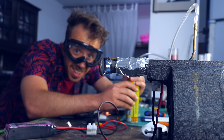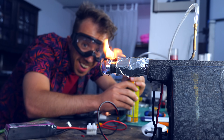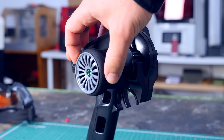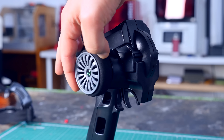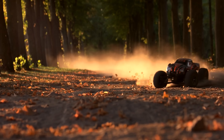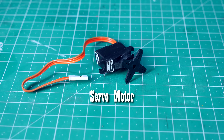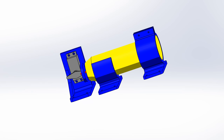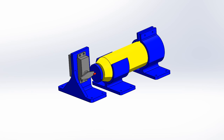The ignition was working pretty well, but I was still delivering the fuel by hand, which is not very fancy. The radio controller I was using to control the EDF has a special wheel used to steer RC cars via a servo motor. Knowing that, I designed the fuel mechanism to press the discharging outlet of a lighter charging can, controlled by that servo.